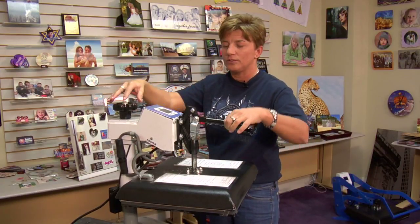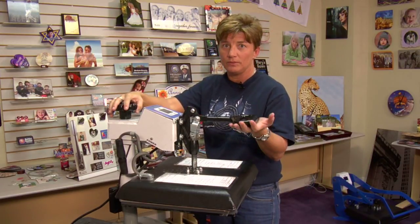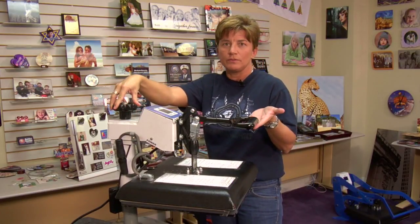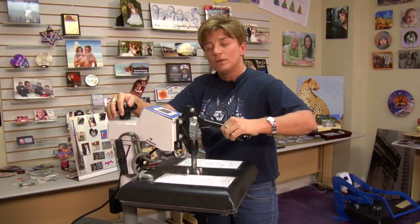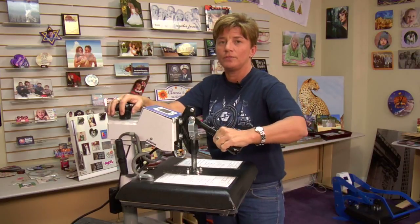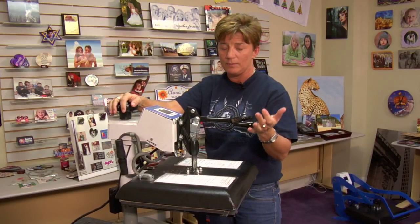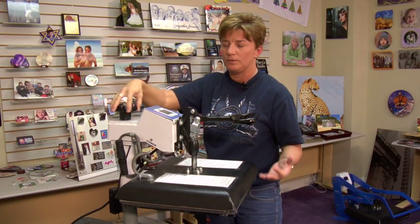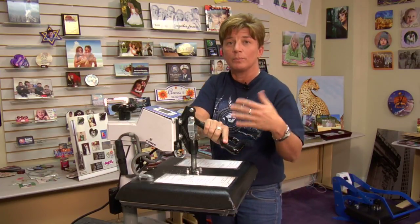What you're looking for is a slight resistance using one hand. If you want medium pressure, release the resistance, let the handle drop, tighten it up a little bit, and you'll see this lever start to raise up. As it's raising up, you're actually increasing the resistance. One and a half hand is medium pressure — slight little snap there. If you want really heavy pressure, raise the lever, let the platen drop freely, turn some more, the lever's going to raise up, putting more resistance, and then two hands is heavy pressure. That's all you need to know about pressure for beginners.